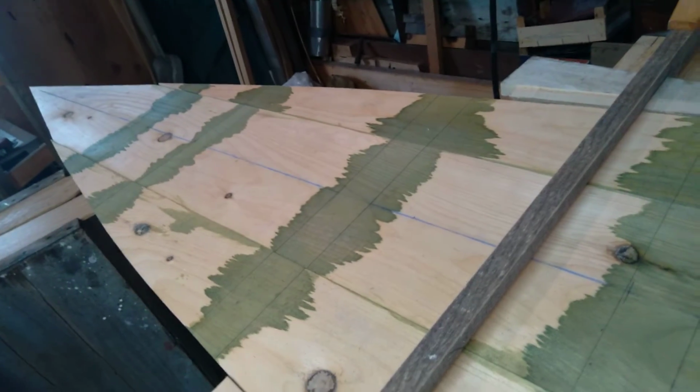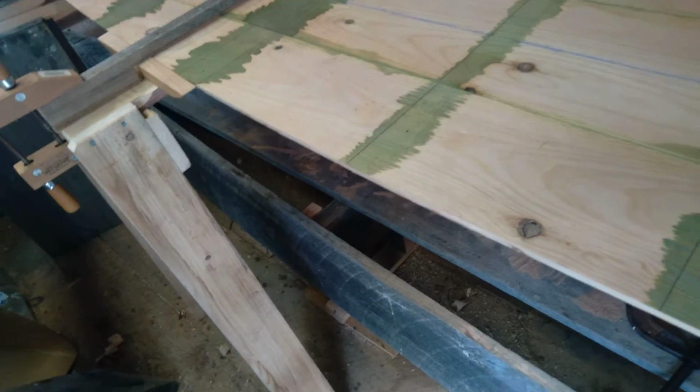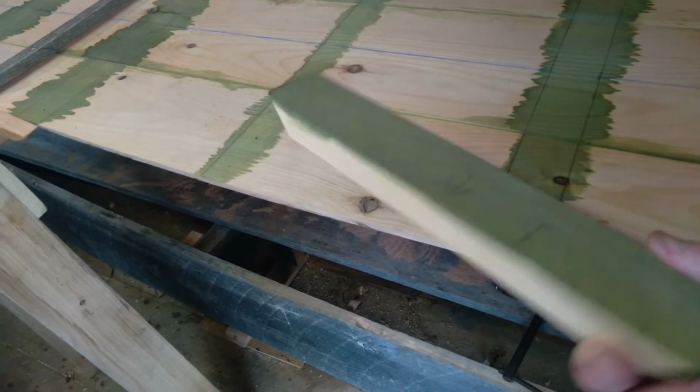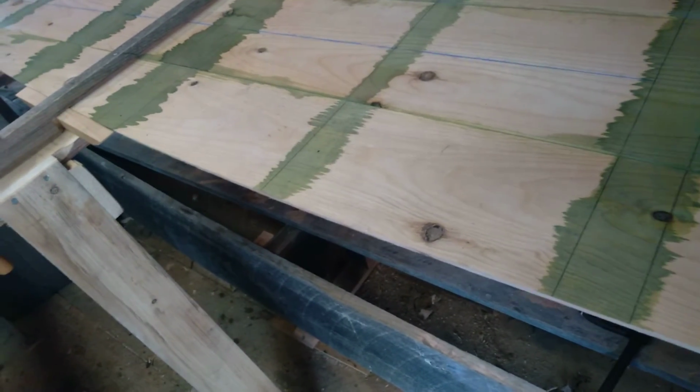Anyway, so in a traditional dory, the cleats would just go on over the pine bottom. You wouldn't have this added step, but it's just something to help with the longevity of the boat. And I also painted the undersides of the cleats with the same cuprous oxide mixture. So those are painted. I did that the other day so that now it's dry, so that I'm not working with and drilling and riveting into wet Cuprinol. Stuff's not the funnest stuff to get on your hands, even though it's not terribly toxic to people.